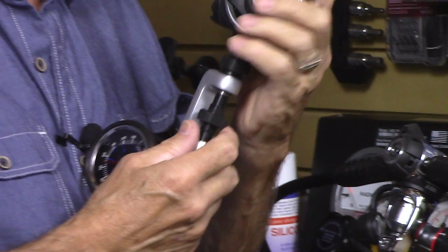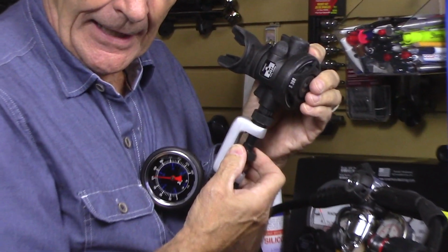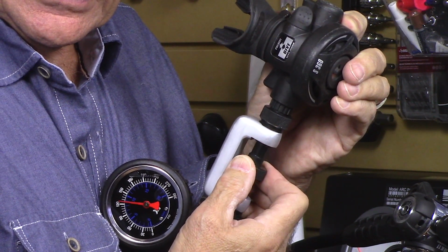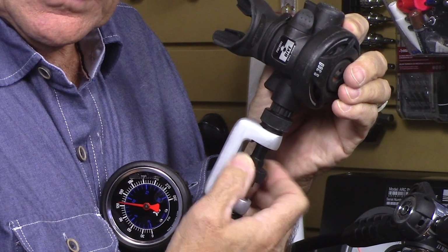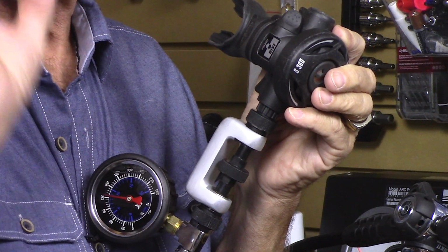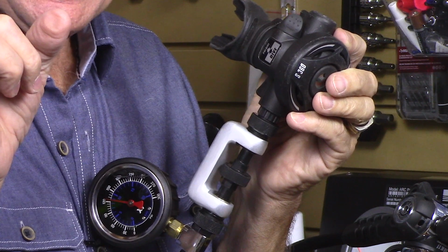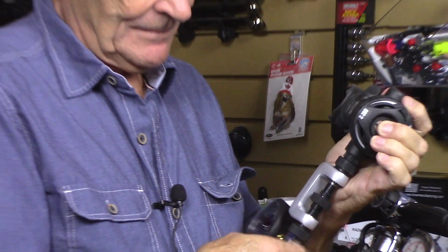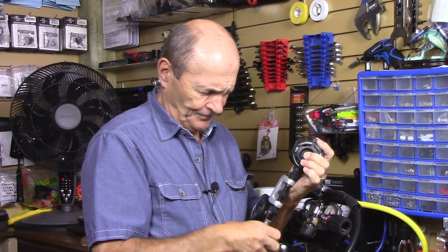Intermediate pressure. Good. You ready? I'm going to turn it counterclockwise, coming out to make it easier. Oh, free flow. Turn it back in a little bit, make it harder. Out, in, out, in, out, in, out, in, out, in. Right there. Perfect. Right on the edge. Not free flowing, but not hard. Simple. Shut the air off. Purge. Take the hose off. Pull this out so you don't change the adjustment. Take this off and put it back together.